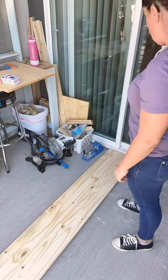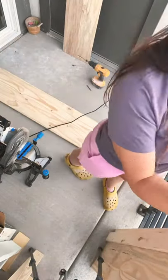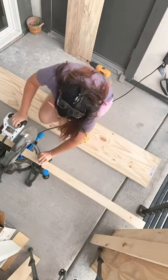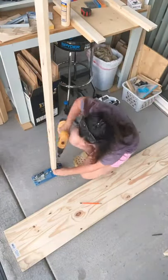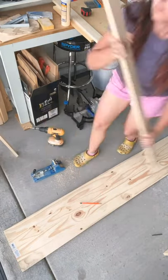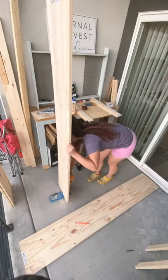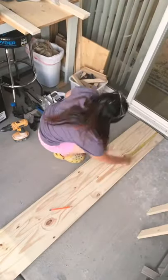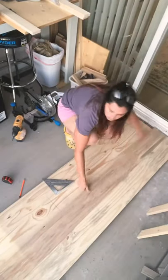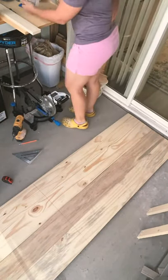One of the tricks to working on a balcony is keeping it very clean, so I've been trying to clean up after each part of the process. Now the pocket holes are all drilled, and I decided to get some one-by-threes to help support each shelf. I'm laying these down on the balcony and cutting them to the same length as the shelving units — six feet long. Then I'm pocket-holing the ends of those as well. Once the pocket holes are all finished, it's time to measure out and mark where each shelf is going to go. I'm putting the bottom shelf four feet above the ground, then using my square to make sure both side pieces were even and the marks were straight across.